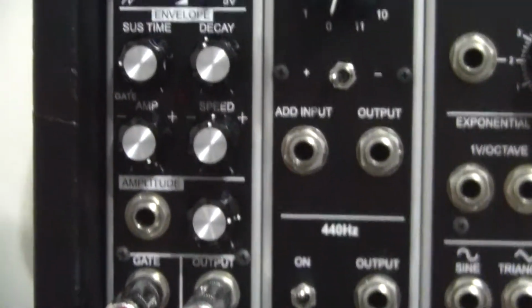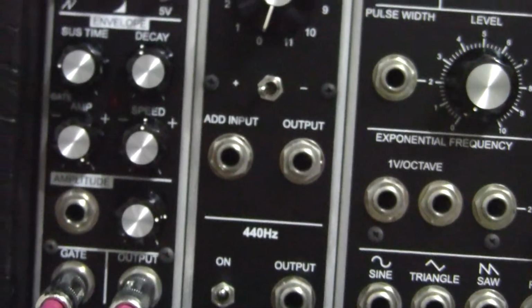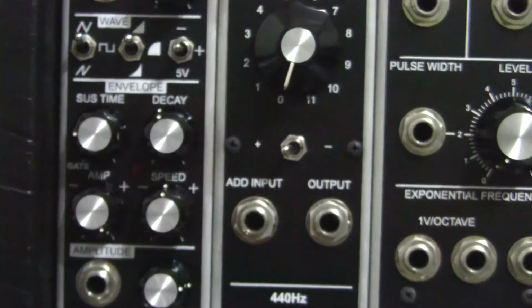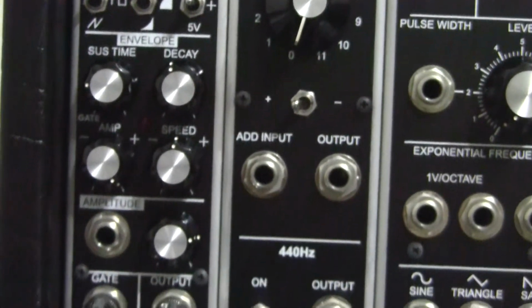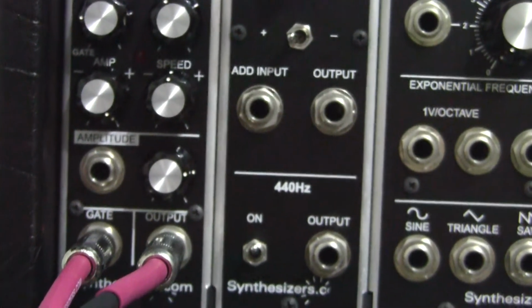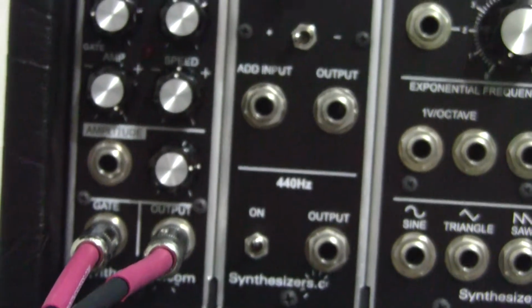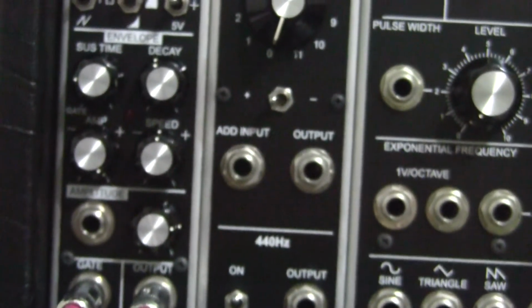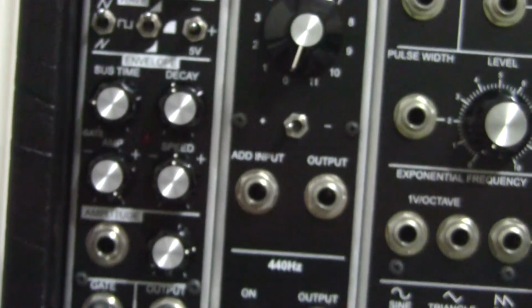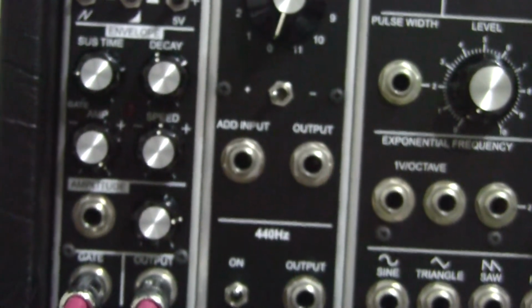Notice our sustain, decay and amplitude settings carefully. Notice we have the amplitude set to 3/4, as I explained in my LFO++ video how to do the settings on this Q167++ module. We are only dealing with delayed amplitude here, the speed is constant.